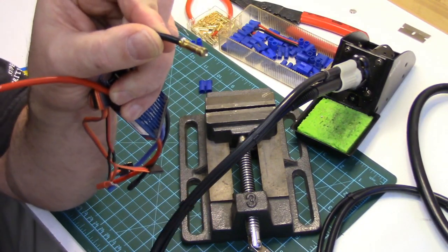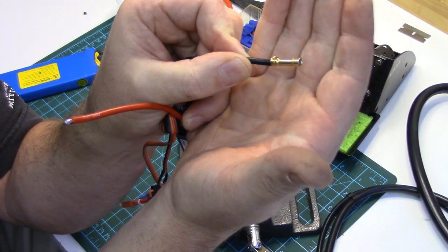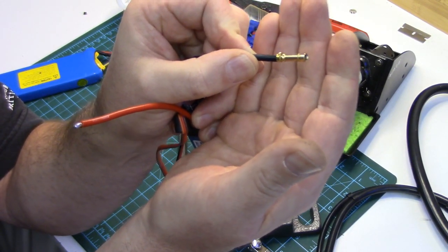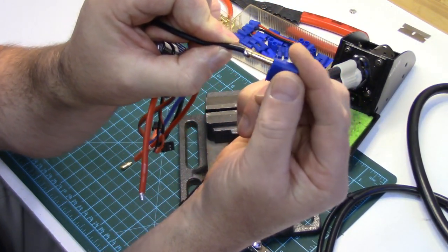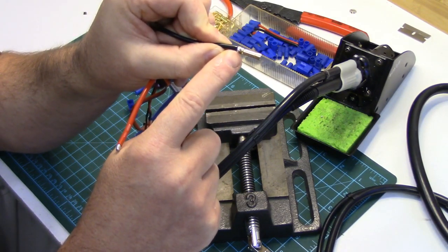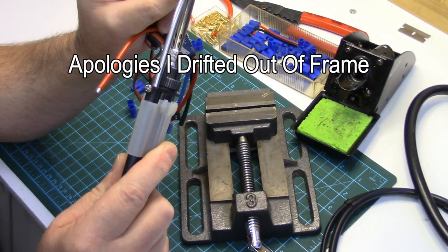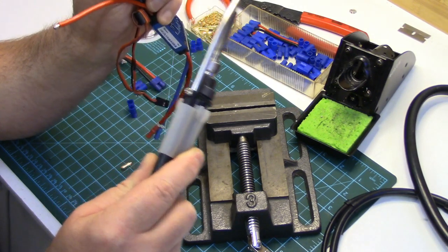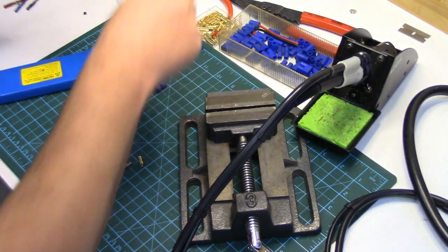There's a problem here — I've got a little dollop of solder on the edge of the pin. It's not in the little recess in the center of the pin, which is good because that's what locks the pin into the housing. But these pins have a very tight fit into the connector housing, so that bubble of solder on the pin will prevent it from sliding all the way in. I'm just going to get the soldering iron and melt that off and spread it.